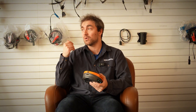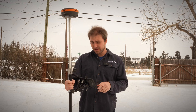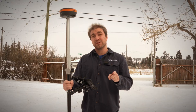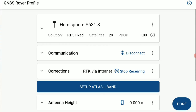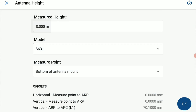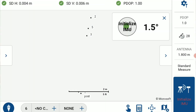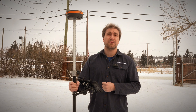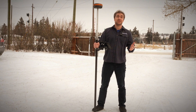With all that said, the tilt sensor on the S631 is incredibly easy to use and very easy to set up. We've got our seventh generation RTK receiver from Hemisphere GNSS and Field Genius Android up and running on this tablet. I've got a fixed solution. I'm going to hit the gear in the top right-hand corner, scroll down, and make sure my HI is set properly — I have a calibrated pole so 1.8 meters is my height. I'll enter 1.8 meters and hit okay. Now I'll click on tilt correction and turn it on. It's going to tell me I have to initialize my IMU, so I'm just going to rock my receiver back and forth. Takes a couple seconds. Now it doesn't say initialize IMU anymore — I'm good to go with my tilt sensor.